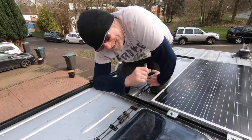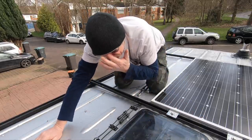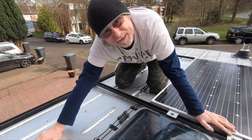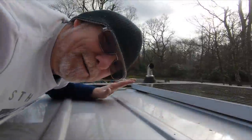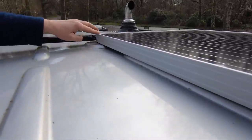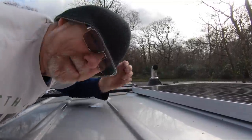Done. And that is a really quick, simple solar panel install. Now I know I'll get asked where I got this solar panel from, so I'll put a link in the description of this video — for the solar panel, the Unistrut, and all that good stuff. Before I get off the roof, this is why I put those felt pads there — as you can see, it's very, very close. It doesn't quite touch, but I didn't want to run the risk of it rubbing and wearing the paint away and causing rust to develop on the roof.